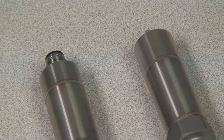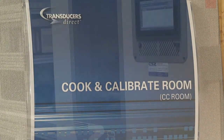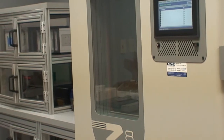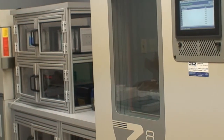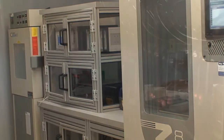After the components are welded, they are inspected and brought to the calibration room. Inserted in a pressure manifold, the TD-1000 is calibrated for temperature extremes across multiple pressure ranges, including zero pressure, midpoint pressure, and high pressure, depending on the pressure range of the header.